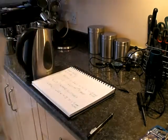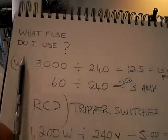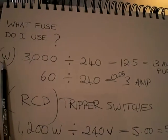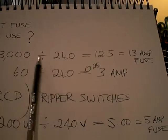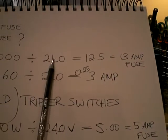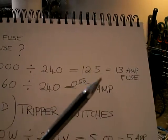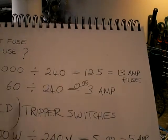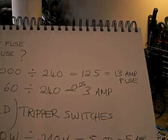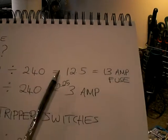So I'm going to work out the fuse that I need for that plug, which is going to be different to the kettle. Now unfortunately a lot of people just slam in a 13 amp fuse and misunderstand that that's not going to give them safety, especially with this lamp. This is how you work it out on a calculator — you divide the watts by the 240 volts coming into your house. This is in the United Kingdom, by the way. And can I just say, I'm not an electrician, so if you need any further advice, please consult a qualified electrician, because you don't get a second chance if you get it wrong.